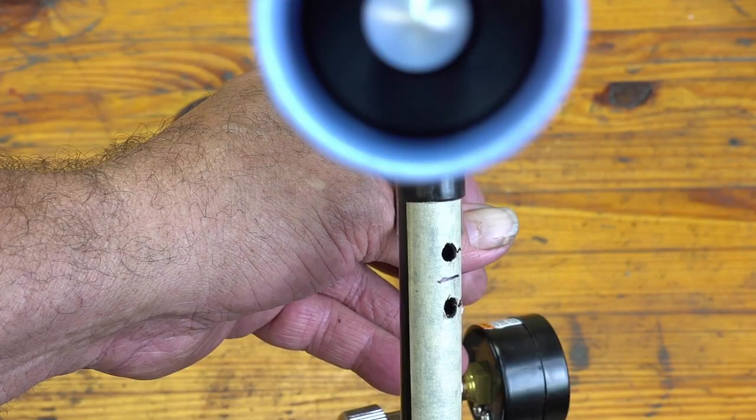The next thing on the list is the mixing tube. When I say mixing tube, that's the tube that actually forces the air into the powder reservoir, and it creates a little vortex in there and gets all the powder mixed with the air. Modification of this tube does help. There's something I can't really seem to catch on film, and that's surging, at least with the Eastwood. I have felt it with the Harbor Freight too in its stock form.